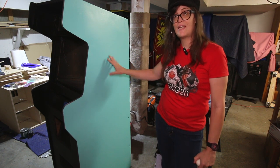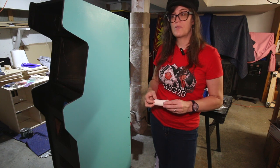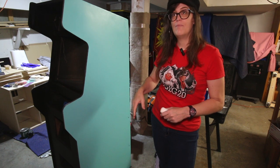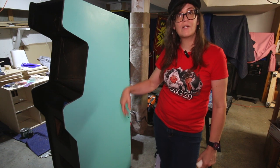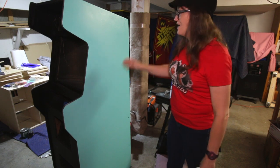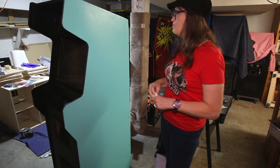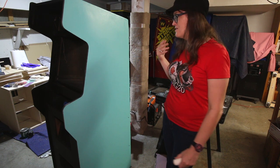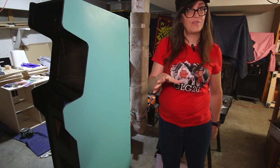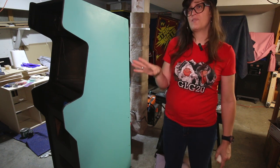Use oil-based paint if you can — highly recommend it. Then you just paint consistently. I like to use what's called a dry paint technique where you don't just stick the roller in a bin, but you put a little bit, almost paint a piece of cardboard, and take that little bit that's on the cardboard and slowly but surely do it. It gives nice, consistent results. You're still going to have to wet sand if you want a really good-looking finish. I also like to do this on a very warm day and stick it out in the sun to hot bake for a couple hours.